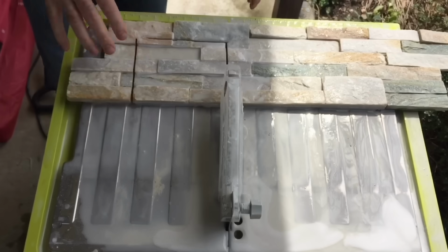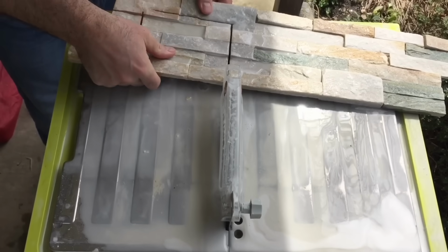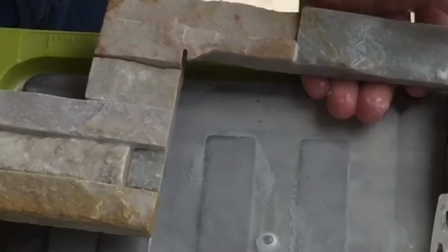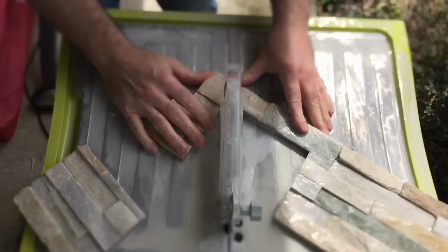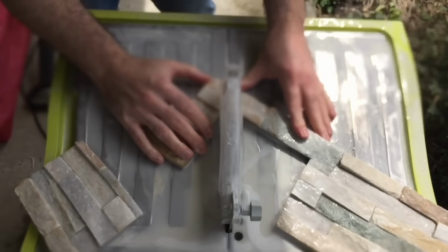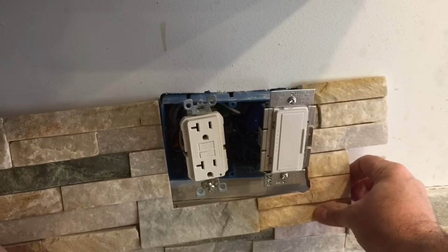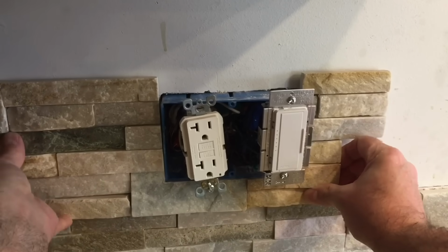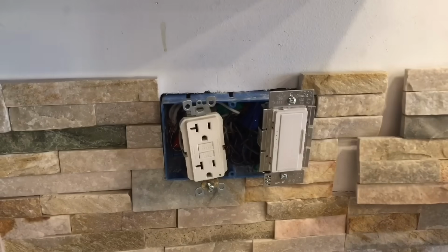And as before, you see me flipping that tile to ensure that I don't overcut onto the facing side due to the curvature of the blade. Now a little tap there, a little bit of pressure, and that cut piece falls away pretty nicely. I do have to nibble away that little bit of extra material there in the corner, but that's a pretty easy process on the saw. And we'll bring it in for a quick dry fit, and that's pretty nice. That fits pretty nicely. Real happy with that.